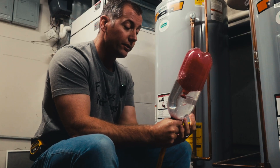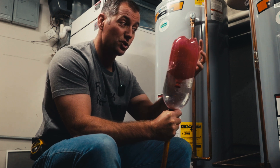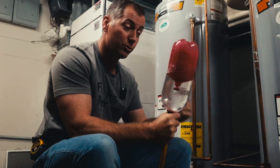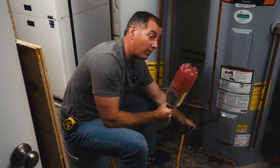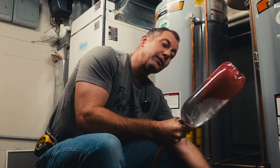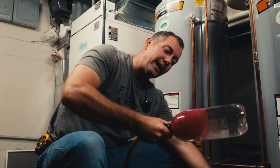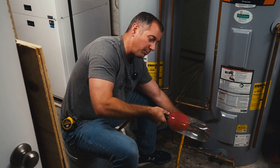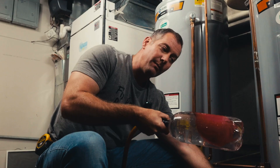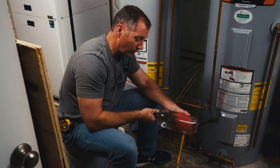As I open this valve, it's going to continue to fill with water and you're actually going to see the balloon inside shrink, because it's increasing the air pressure in that balloon tremendously. Here we go — we're adding a little bit of water and that balloon is getting smaller and smaller. If I flip this over you can see the balloon is no longer rubbing on the sides of the tank — it slides up and down. I can add just a little bit more and make the balloon even smaller.